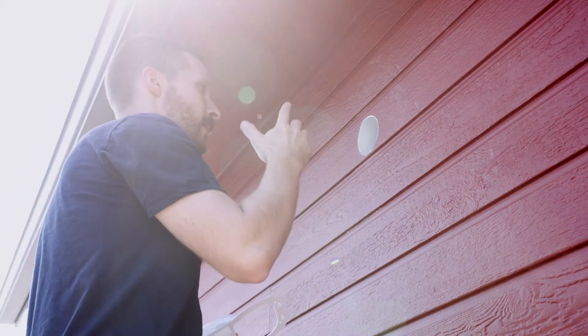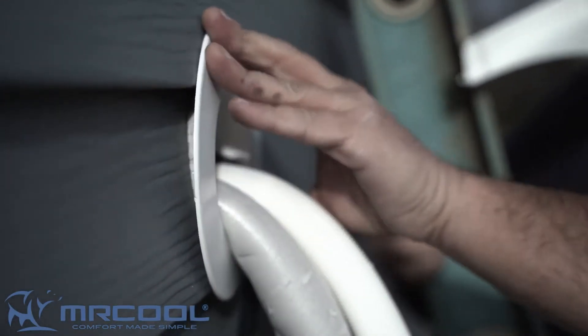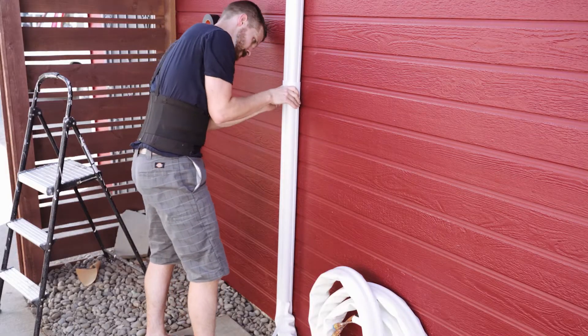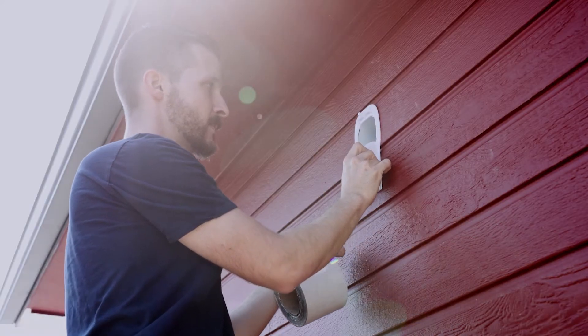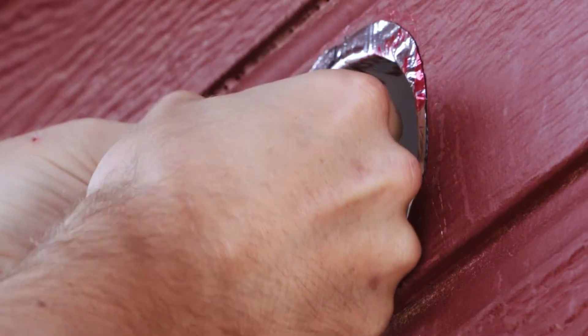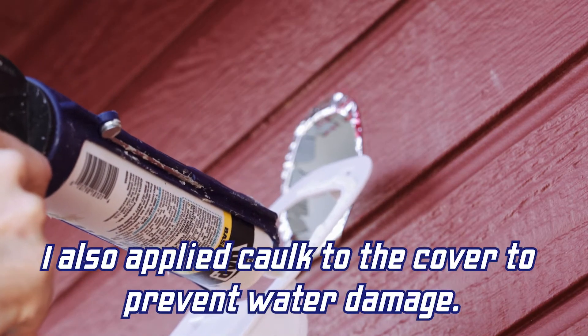We got our wall sleeve here, nice and trimmed flush to the side of the wall. Something annoying has happened — I'm missing a piece. There's a cap that goes right here. I double, triple, quadruple checked my packaging and I'm pretty sure it is not in there and that they forgot to include this part. So I'm going to have a plastic cover for the refrigerant lines, the power and everything, and the first piece that comes with that is this, which is going to go right here. What I'm going to do is use some exterior flashing tape that I'm going to put in here, and then I will install the cover and we can keep going. Not the end of the world — sometimes this happens, but flashing tape should make it no problem at all.